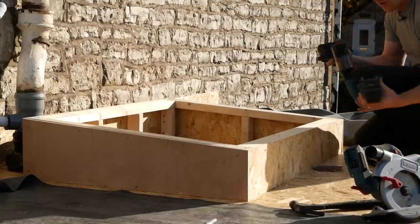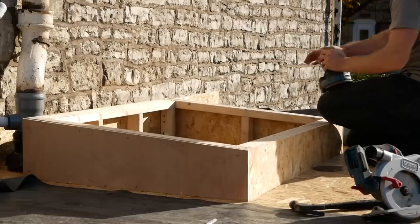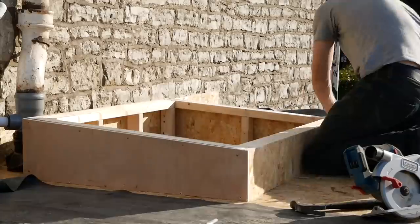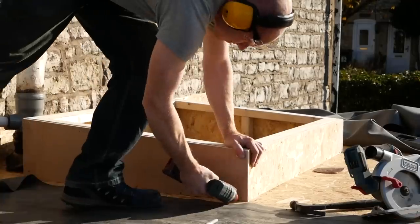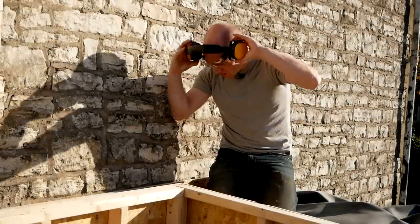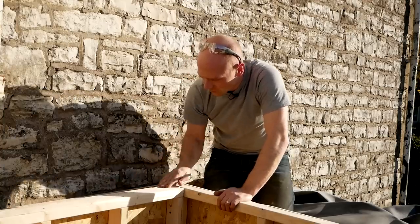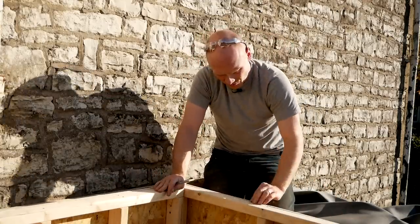The final thing I'm going to do is just give all the rough edges and rough corners the top of a bit of a rough sanding. Another option you've got is to just let the OSB run a little bit long — as with anything really — and then just use a flush trim bit running on the top of this. I guess that's another way of doing it.